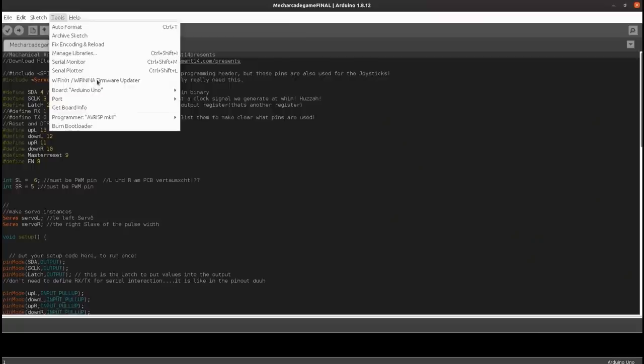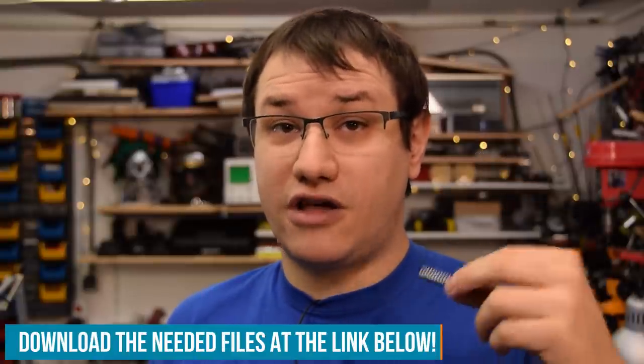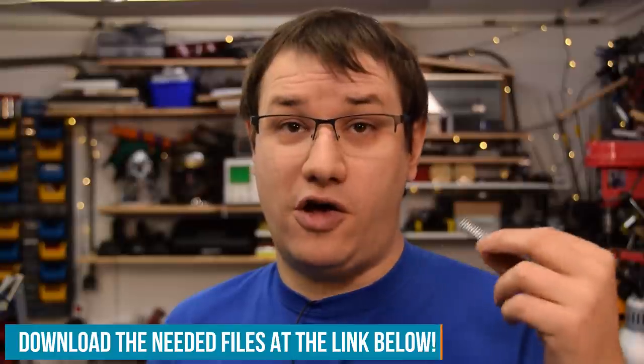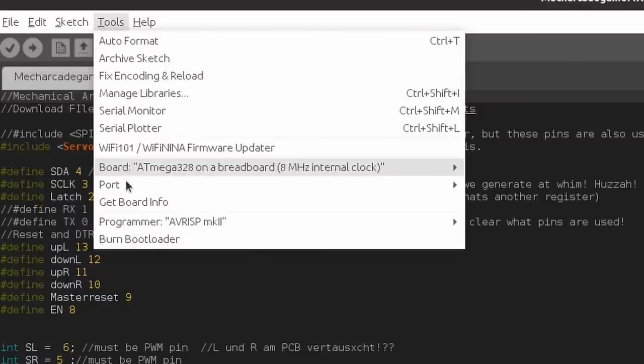Within the Arduino IDE, all these Arduino boards are defined with the boards text file and other files that go with them. But these bare chips have a different configuration than all the other boards. So what you have to do is put a bare minimum configuration into your Arduino IDE. I have put a link where you can download such a configuration on the element14 community page for this video. Insert that in your Arduino IDE, and then we have to flash this chip in a different way.